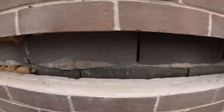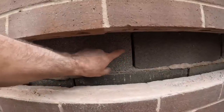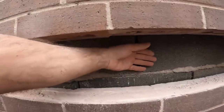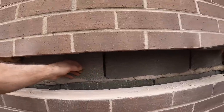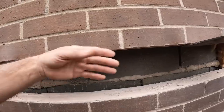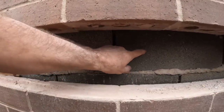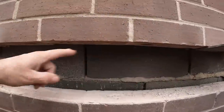Yeah, so that's all out. That's where our Lintels are going. We're not touching this. We're going to try and take as much of this out from this side as we can. But I can't see if the joists are on this wall or not. I'm pretty sure they should be. But it's a semi, so maybe we could go front to back onto a solid wall in the middle. But anyway, these are hollow blocks. We take the whole back of the blocks out, and then we can prop them from the other side.